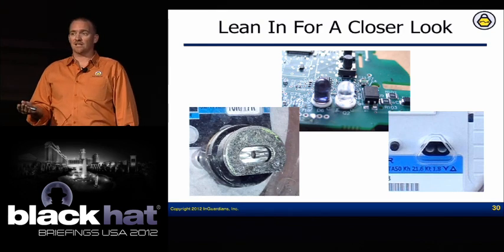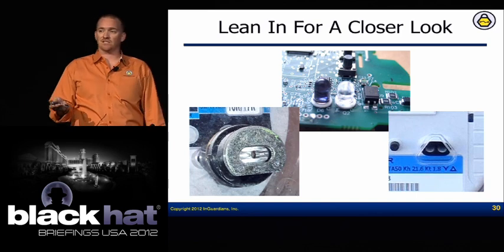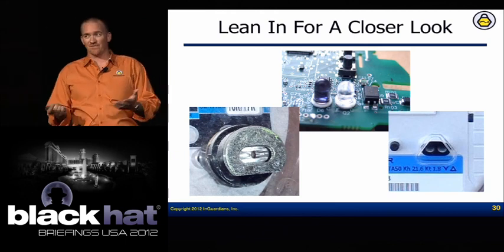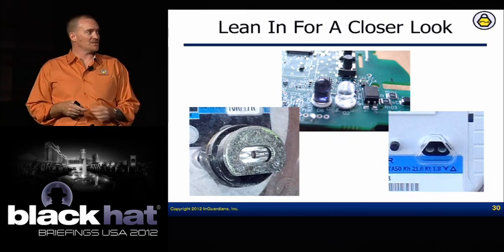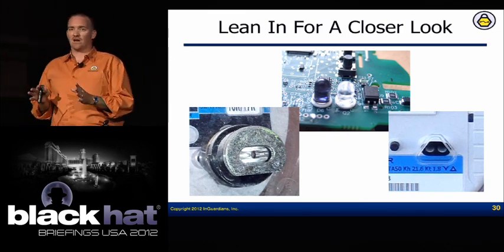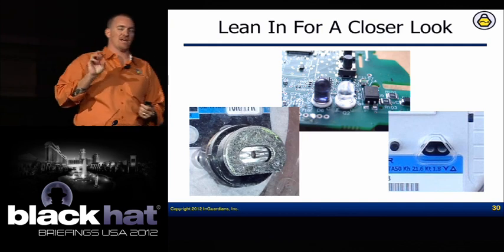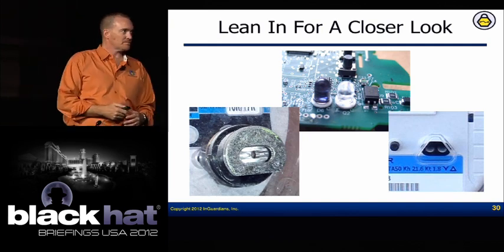Well, it's just IR LEDs. It's actually outlined in the C1218 specification, so you can build your own. They're supposed to be built to a standard, and generally each manufacturer sticks to the standard you see on the left-hand side of the screen. But as you can see on the right-hand side, some people do modify it a little bit. What's great is the one on the left is a metal plate, because most of the optical ports have a magnet on there. You just set it on there, and then you don't have to touch it. You can just work with it.